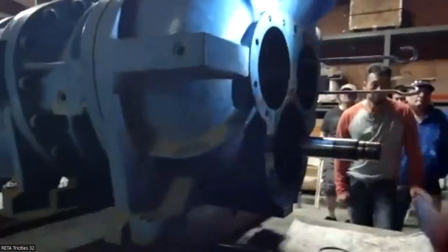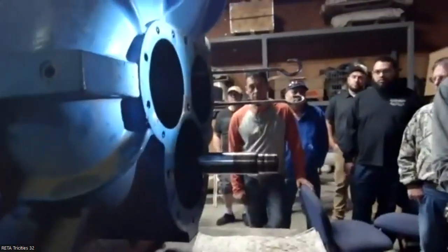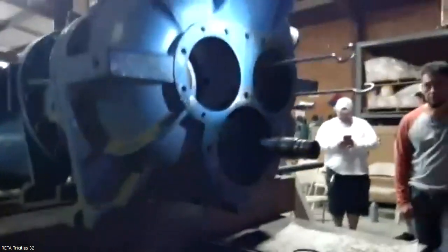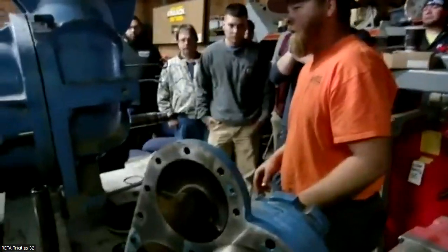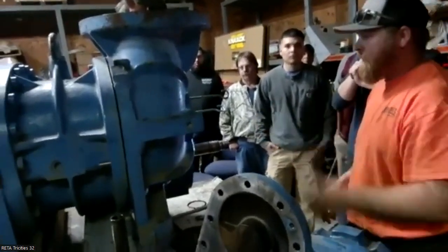No problem. If you guys want to look on this side, the female, it's visible right now. Here are the sleeve bearings, the lower bearings, where these sleeves are placed. I will say I do see a lot more of the lower bearings fail, as far as the sleeves generally get wiped from lack of lubrication. That can come from liquid sludge, which will do that, or wipe the oil away, and then the rotor drags on and wipes them. I have not had this one apart to know if these ones are wiped yet, so I have not actually taken the suction head off.